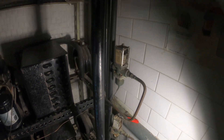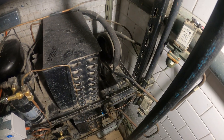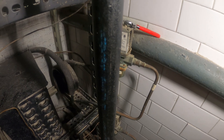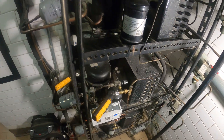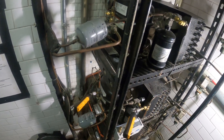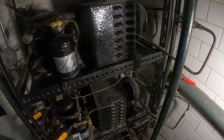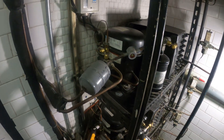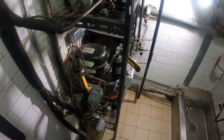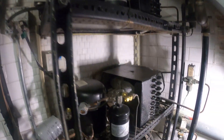Unfortunately there is no strainer on these lines — I'm definitely going to recommend they install one to protect this water loop. These water-regulating valves look bad, but they are working. The temperatures in the box are looking good. It was pretty much as simple as that: the thermostat was not set correctly and the water-regulating valve needed to be adjusted accordingly. Just going to give this a little more time to make sure we satisfy at the correct temperature. If anyone found this video interesting or helpful, please drop a like, comment, and subscribe — and I'll catch you all next time.